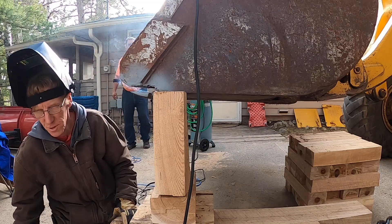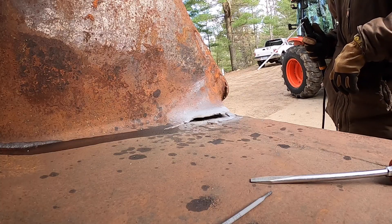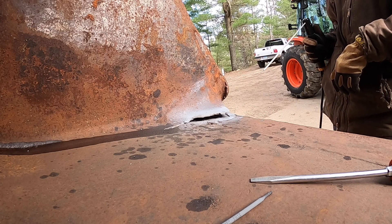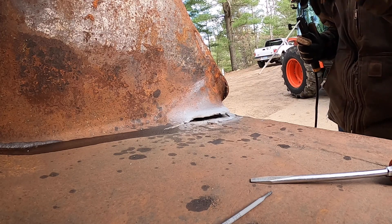Right there, that's all we should need. You just did a 6010 rod on 110. It was a Miller — yeah. What do you got, 135? Turn that down to 110. You want 110. I'll let you know if it's different. It won't let me go down really — 115, that's fine.